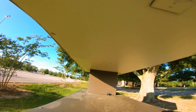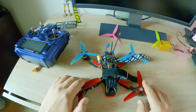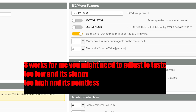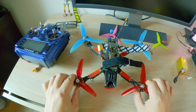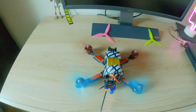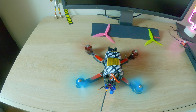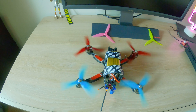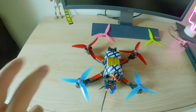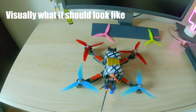So that is why I have it, and let me show you how to do it. It's pretty easy. It's similar to dynamic idle, which I also have on here, but that's in the tuning video. So 3% is a good value for air mode for this, or 3.3 — it's going to be a little different for everybody. If it's struggling to spin, that's no good. Arming the quad with no idle up, and then shortly after I'll do the idle up. You want to have it actually spinning relatively fast. The idea is to be able to fly with idle up off as well, so you don't want the motor spinning so low that it creates issues.